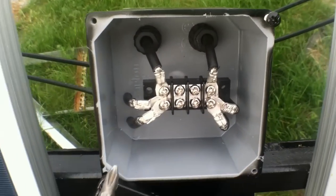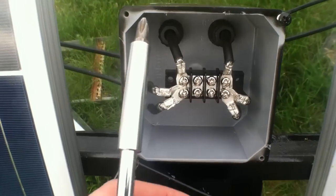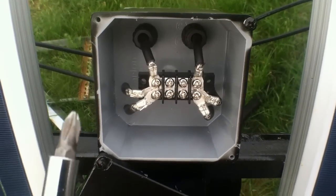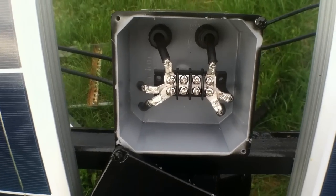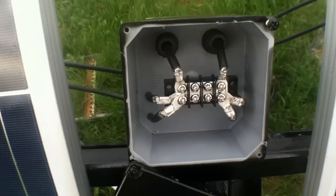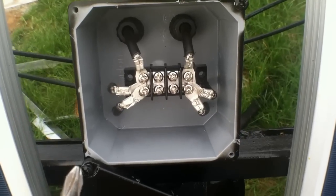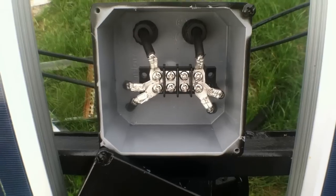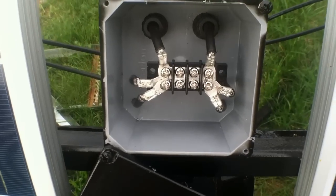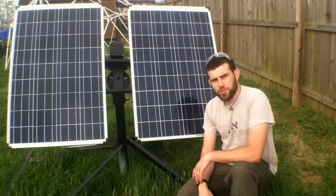The wires have come in from the hot side and are wired across the bus bar out to the MC4, and the ground side has come in and done exactly the same. One important safety note: today was partly cloudy with barely any light, but there was still just enough that I got the leads a little close and got nipped with electricity. It's best to do this final wiring at nighttime, especially if you're a beginner, so you don't have to worry about getting shocked. Even with my experience, I got a little shock today. Now we'll put the lid back on and move to the final finish.